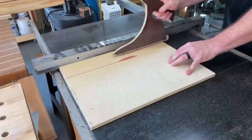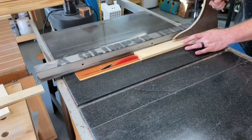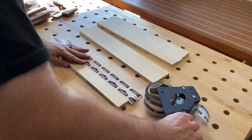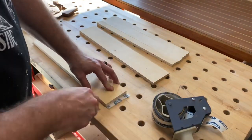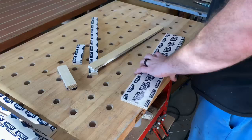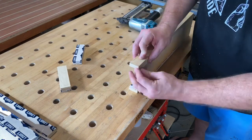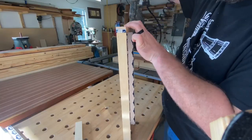This is a necessary process because I'm going to make some molds and the molds just aren't that big. I'm going to rip down some pieces of Baltic birch and line these pieces with house wrap tape. In my experience using epoxy and making molds, house wrap tape is by far the least sticky — epoxy resin doesn't really stick to it very well and it does come out fairly easy compared to other options. I've tried sheets of PVC and wasn't a big fan of that. If you're going to start getting into epoxy and pouring molds, I definitely recommend using house wrap tape on plywood. It works very, very well.